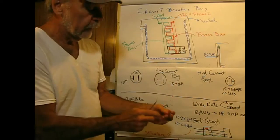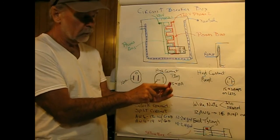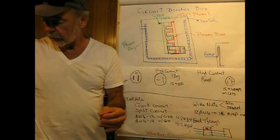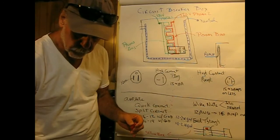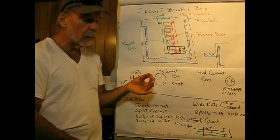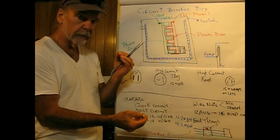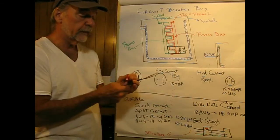This is what they look like, and inside of one, you can't see it, there's a wire spring that looks like an ice cream cone metal. It comes up to here, and what that spring does, when you put it on wires, is it bites into the wire and therefore makes a connection. Now, when you buy these, the box will tell you the minimum and maximum gauge of the wire, and in addition to that, how many you can fit in. So for example, a yellow wire nut at maximum can take 3 12 gauge wires, and to me that looks pretty tight, so I don't use yellow. I use red, which can also take 3 12 gauge wires.